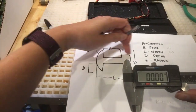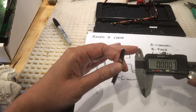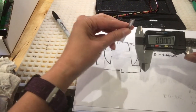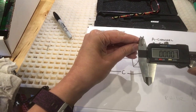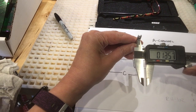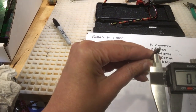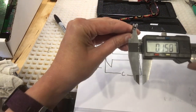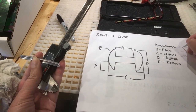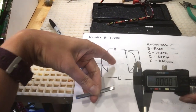I want the channel, the inside, a little different. The top of your caliper measures the inside of something. The bottom of the caliper measures the outside. So we have to measure the inside. So I'll use the top part of the caliper. I'll put my channel in there and then slowly open it. And you see how it opens there. It's kind of cool. And A is about 0.158. 0.158 is A. And then the last, set this back to 0, is the depth, this distance.